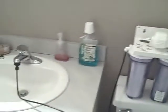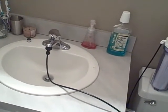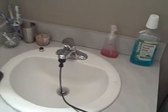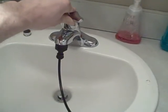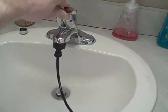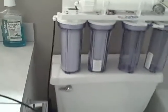We're going to put both the blue and the yellow lines into a drain, so I just have them draining into the tub. Then slowly turn on the cold water — don't have anything higher than 75 PSI.